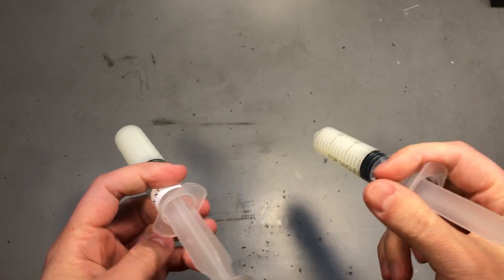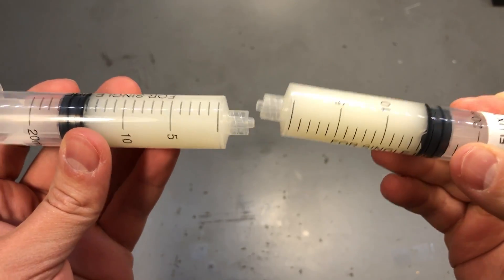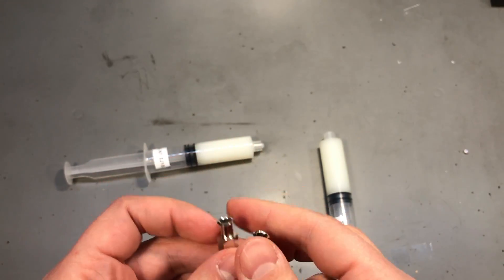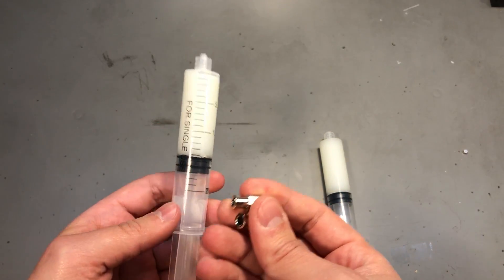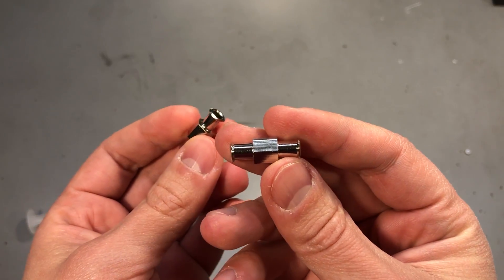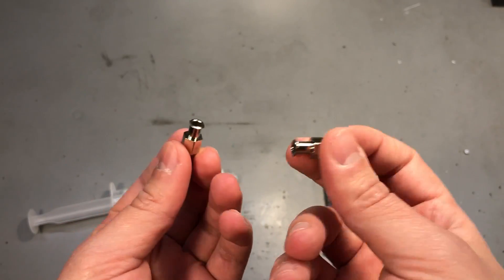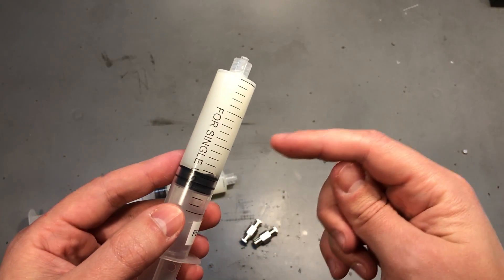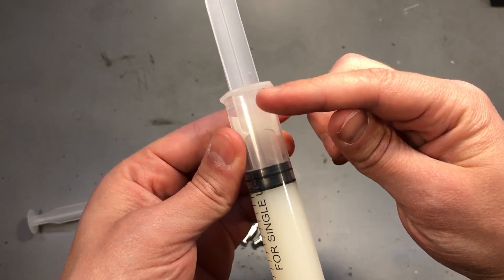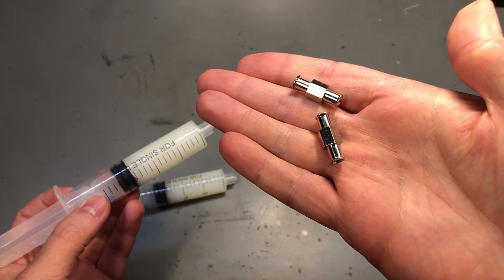How do you transfer something like gel flux from one syringe to another? You could improvise with a piece of tubing, 3D print something, or buy these special luer lock adapters — because flux generally comes in luer lock type syringes, and even if you buy syringes yourself it's best to get them with this luer lock fitting. I gave these adapters a quick bath in isopropyl alcohol for disinfection. An advantage to transferring flux into a syringe through the bottom is that you get a cavity filled with liquid with no air pockets and without getting the rest of the syringe dirty. A link will be provided in the description below the video.